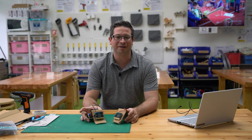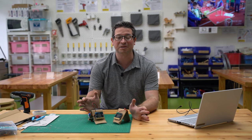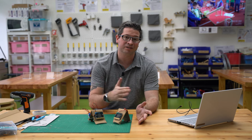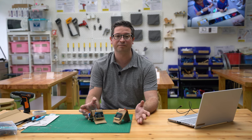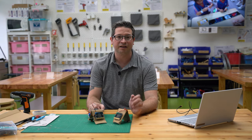I hope you've learned a little something about using servos, some of the challenges, and some of the things you can do with them. With positional servos, if you want something that's going to move, you can change the angles and change the pause and delay between them to make models quite simply that have moving parts, repeated over and over again. I hope that was helpful!